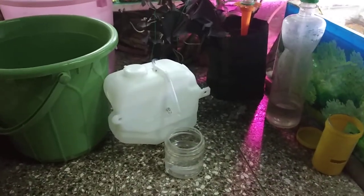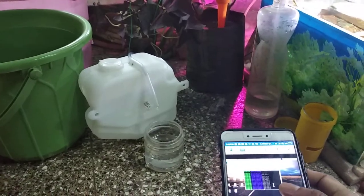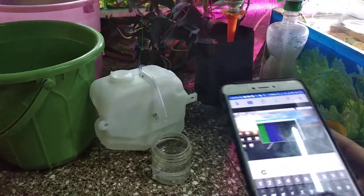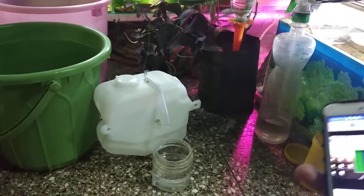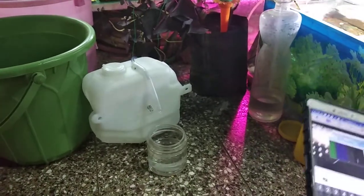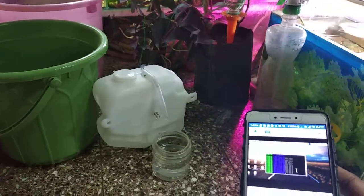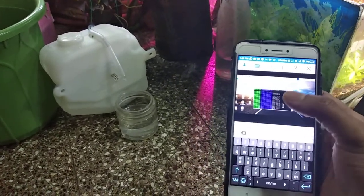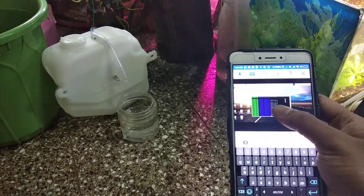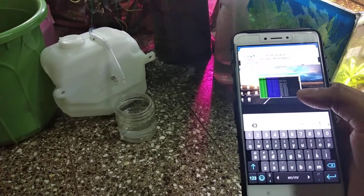When I'm on vacation, a cron job will be scheduled at a certain time to trigger this script, which tells the motor to turn on and water the plant. A USB webcam will take a photo of the plant and email it to me so I get a daily update. If I want to water the plant more, I can manually take control from anywhere in the world using a virtual network connection with the Raspberry Pi.